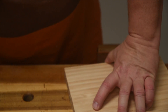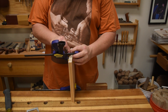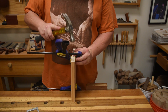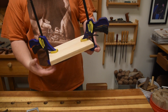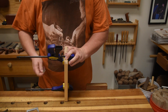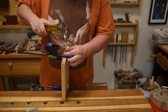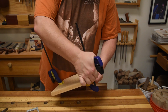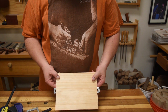And how you work them is — what I would do is clamp the boards together, then figure some way that you can drive the dogs, one dog in between every two boards. This right here alone will keep the boards together and they actually add a lot of pressure to cinch them together. Take these off and they will hold it while the glue dries, really easily.